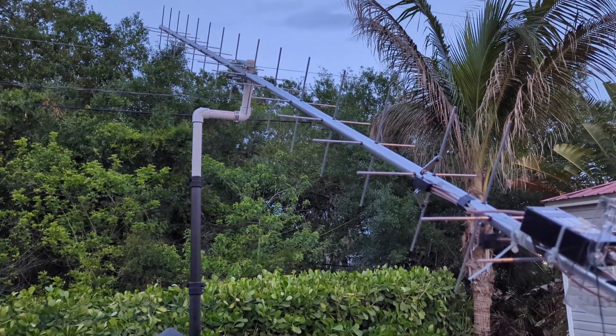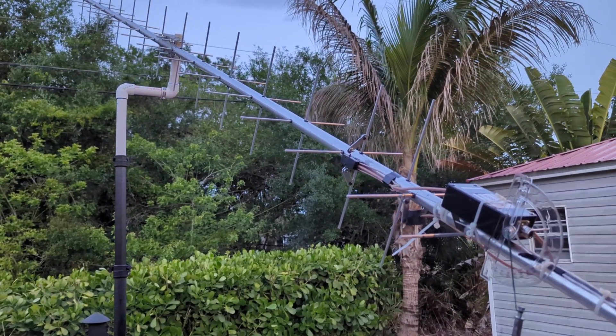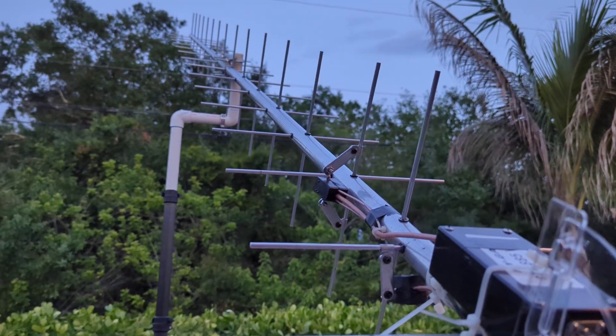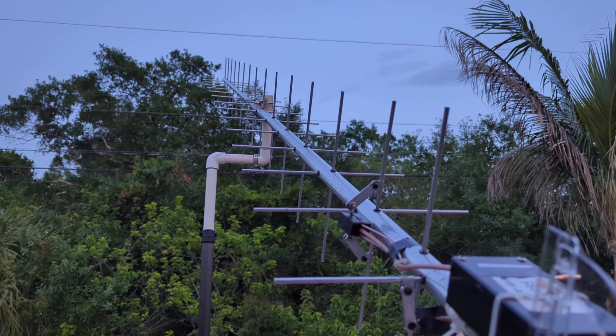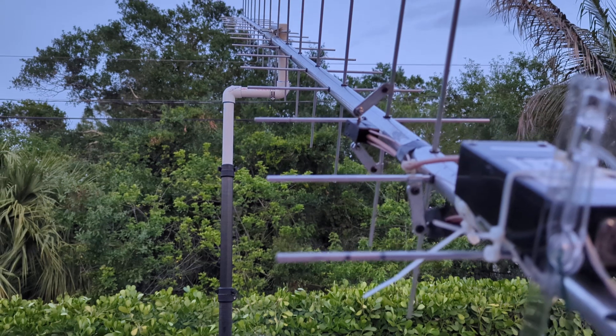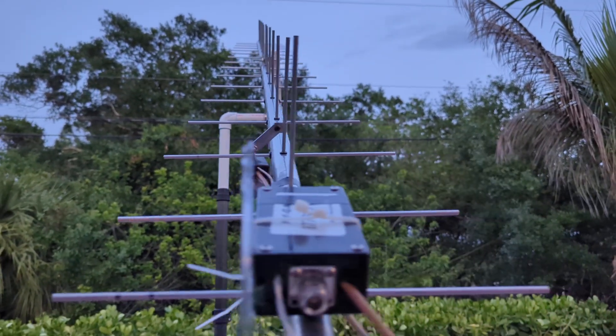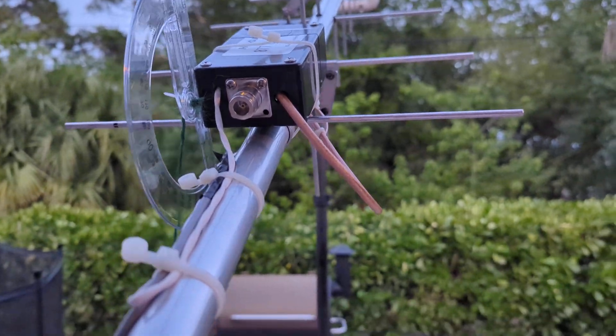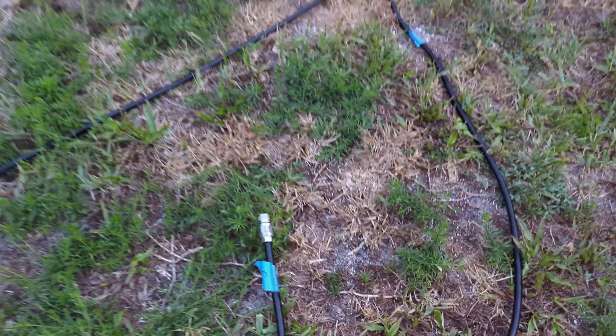So it's got some directivity to it, but is it supposed to be dominant on horizontal or vertical, or is it a combination of both? Because this is a horizontal Yagi right now and I'm not sure the circular is working, but I got the SWR where I need it. I did receive traces on Q65 from a couple of stations but it wouldn't decode — it was really down in there. I don't have a preamp; I do need to get one. I was using the seven-eighths inch heliax with some N connectors on the end.